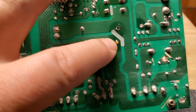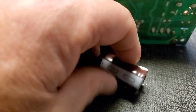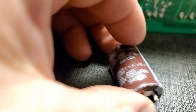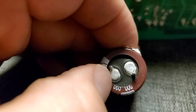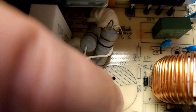Here's the bottom of the board. I took a soldering iron to the pins that come through the board, warmed the solder, and was able to pull the blown capacitor. Just for reference, the rating on the capacitor is 200 volts, 680 microfarads, 105 degrees Celsius. You can type these specs into the internet and find these all over the place. When you solder it back, you can see the printed terminal on the capacitor and then there's a smooth terminal. Those correspond to the positions on the board — the shaded part is where the printed terminal goes, and the shiny terminal goes on the other side.